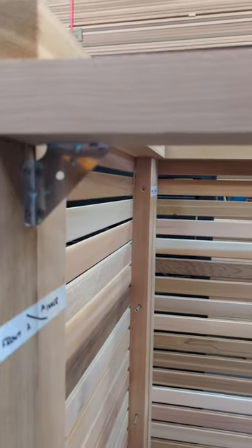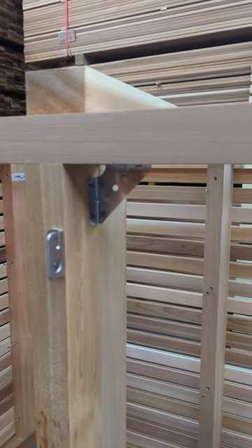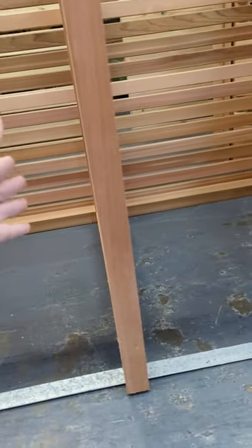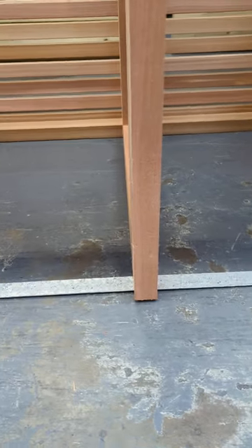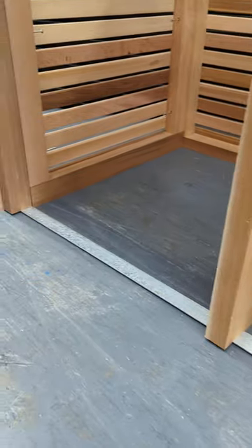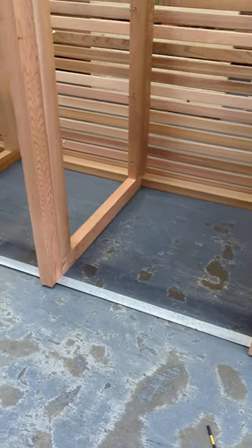You've got these little supports there - that's to stop your door going too far in, a nice simple touch. And you can see our support plate running right the way through. That's to stop this inner framework from moving side to side - when you've got your door on you don't want that moving. We use a flat plate there that keeps the inner support fixed firm, screwed in from underneath. It also means when you're taking your bin in and out there's no wooden step, so if the bin's full and heavy you're not struggling.